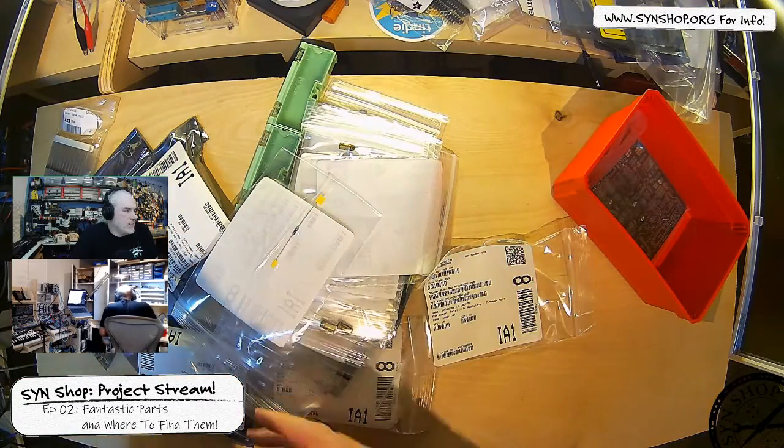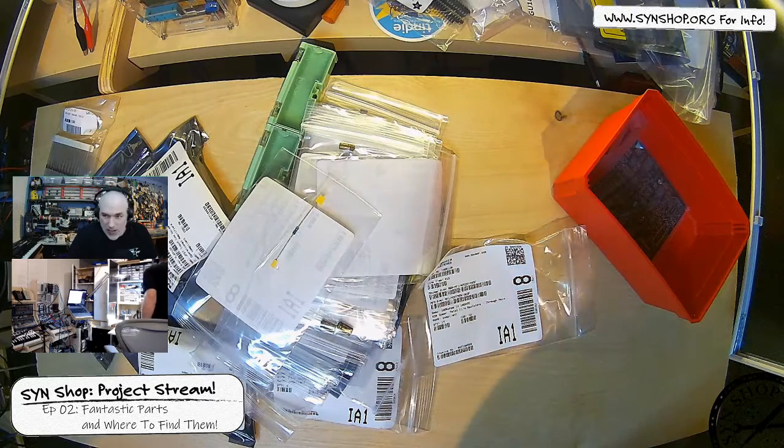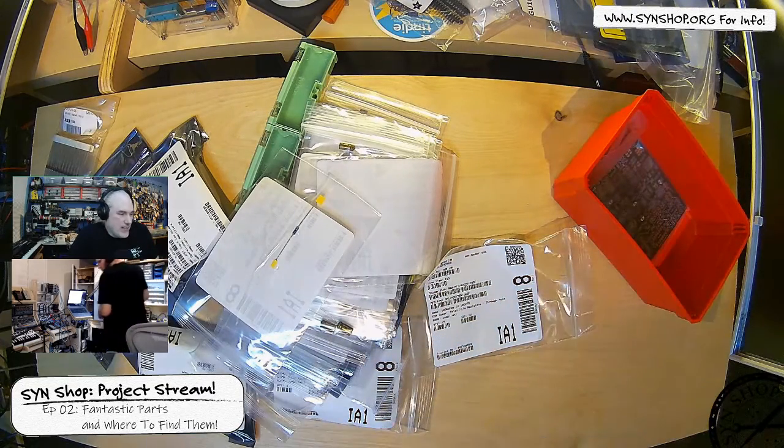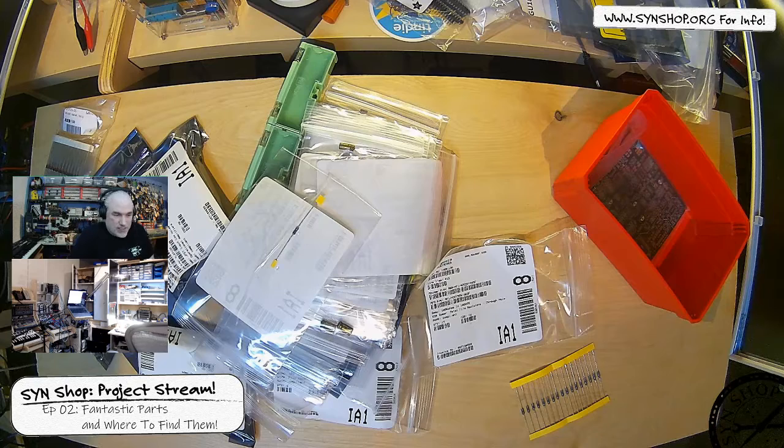Generally, with resistors, you just have to worry about, one, that the wattage is going to meet whatever your requirements are for current, and that the actual value is within the percentage tolerance of what's acceptable. So you can have resistors that are 15% tolerance or 5% tolerance or 1% tolerance, and you pay more for ones that are more accurate to the value that you need. And then you can even go so far as ones that are specced out to it is exactly this amount. Oh wow, that sounds pricey.